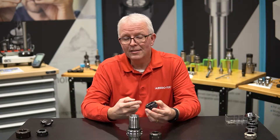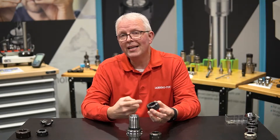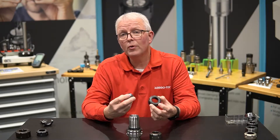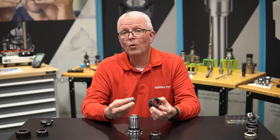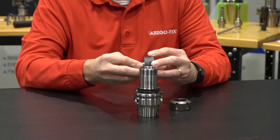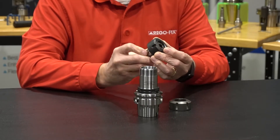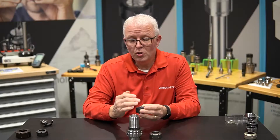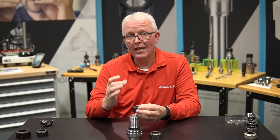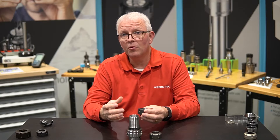It's a multi-piece nut — there's just the outside body and there's an inside race. Two chemically treated surfaces reducing the friction. What's important is what it does with that friction: it takes the friction away from the top of the collet and places all the force inside the nut itself. So there's no more drag or pull on the top of that collet.